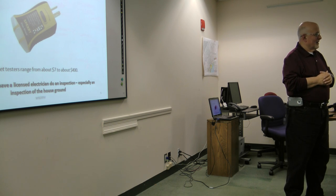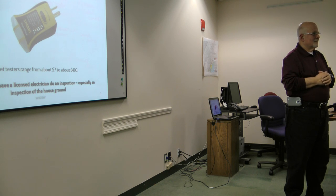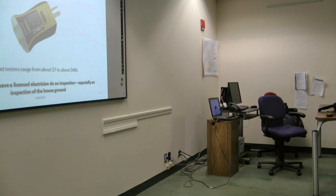Which is green. Right. Inside the box, I'm not sure how they're doing it here, but in Poland, I know when they're doing the grounding on a house or any building, before the grounding is attached, they measure the impedance of it to see if there are enough rods and all the things. So they do this and they measure whether there is enough grounding.